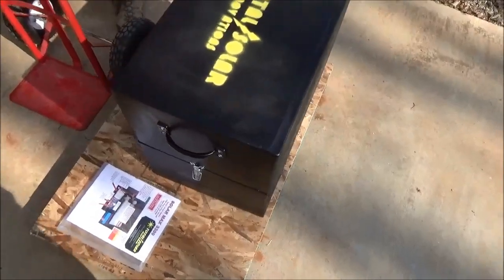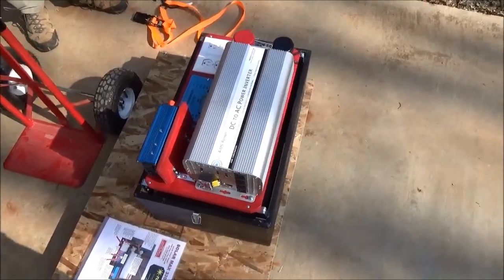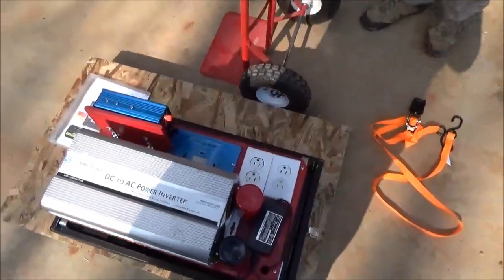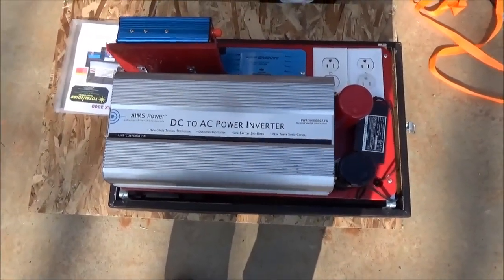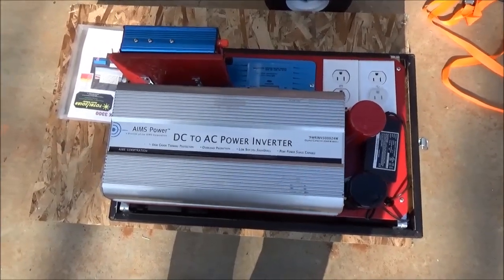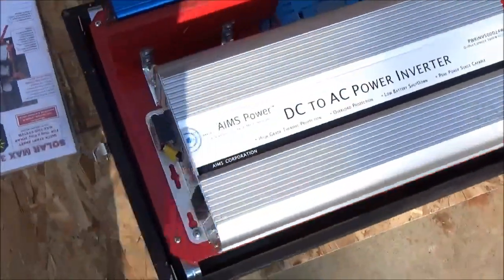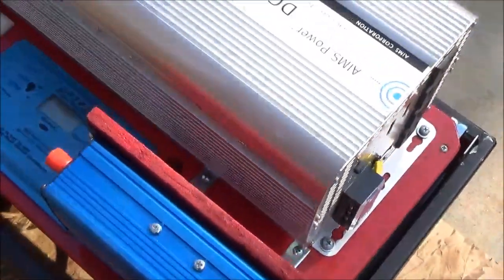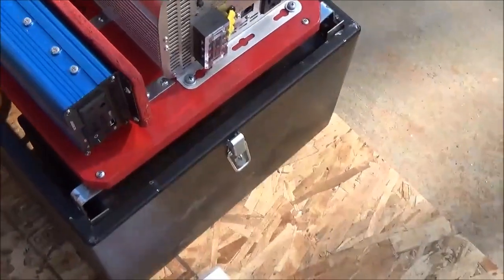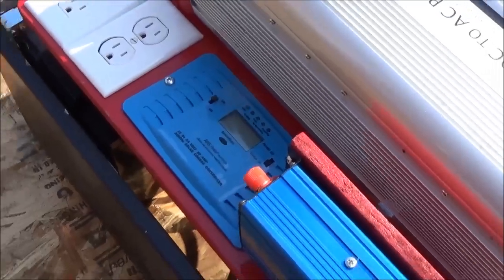Let's open it up and show you what's inside. With the Solar Max 3300 there's a variety of inverters. You get a 4000-watt modified sine inverter with a 5000-watt max output capacity — that's an AIMS inverter. You also get a pure sine wave 300-watt AIMS inverter for your critical electronics that aren't happy running off the modified sine wave — just plug them into the duplex receptacle. There's also a 30-amp charge controller and some plug-in ports.